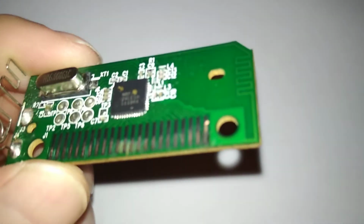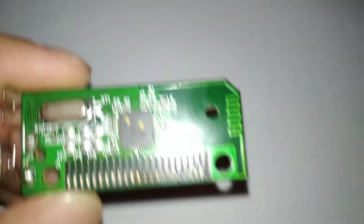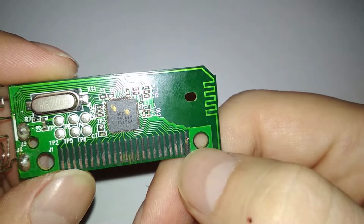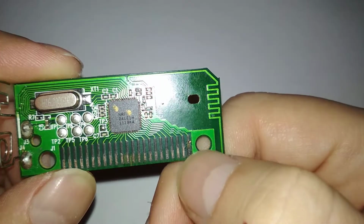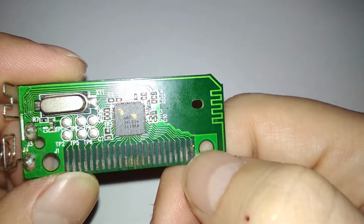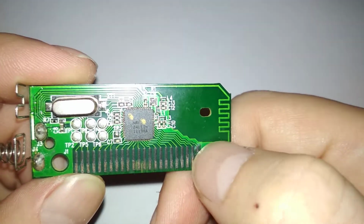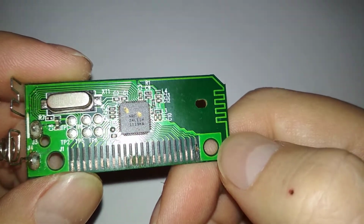Focus. Let me show you how I burnt it off. It doesn't want to focus. But why? Like this. You can kind of see it. Basically this contact is burnt up to here. It has no thermal mass, so as soon as I touch it with the soldering iron, it just burns off. So that's a really bad idea. Luckily I still have some of it left here. I can still make a contact.